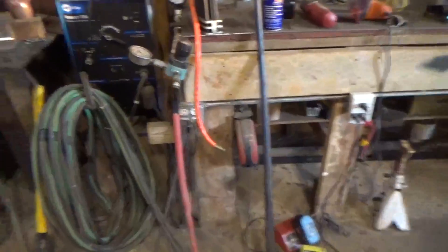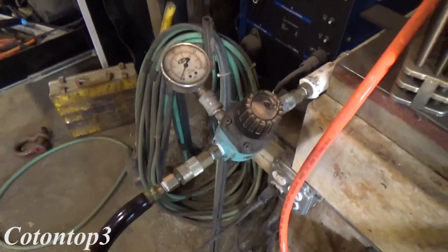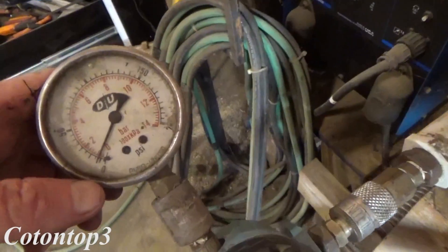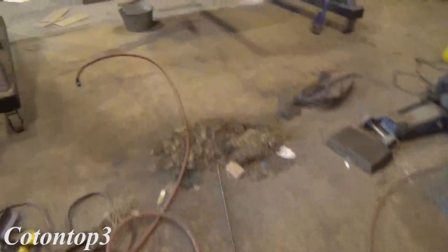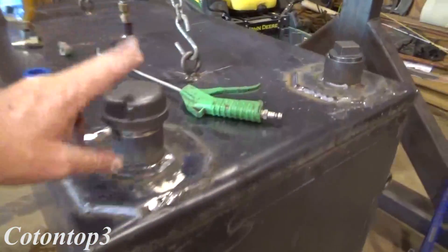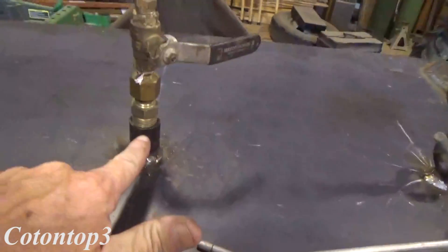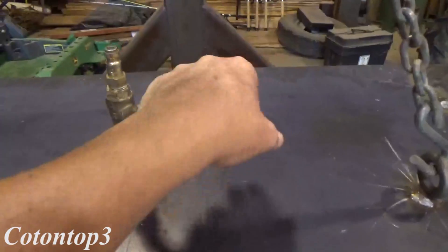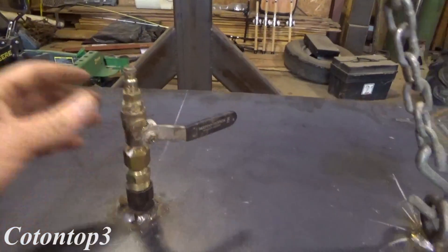Waiting on the compressor to turn off. Somebody asked me how I do this — this is how. I've got a regulator here on the air, turned way way down, so there's virtually not much pressure on that hose. I got this cap tightened down, got that plug tightened down, got thread tape on them. Then I come right here to the vent, put a fitting in there, put a ball valve on it, connect my air hose — that way I can control the pressure. I just put a little air in there when the compressor kicked on, then stopped and put my regulator on.